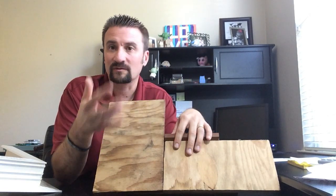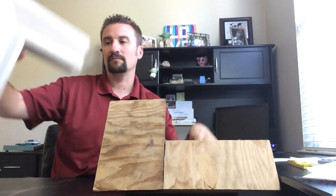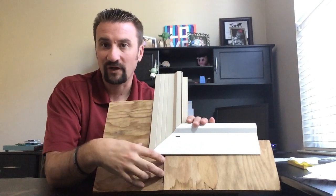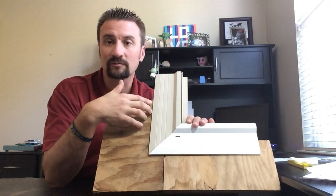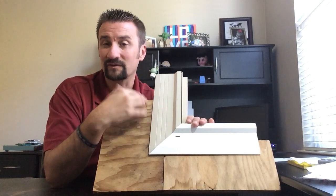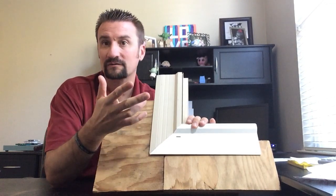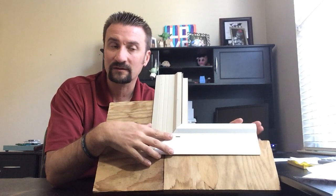So the problem is sometimes people will put a replacement window, which basically means that they're going right over the top of the stucco. If there's any sort of flashing issue on this wall prior to that installation, sometimes it'll even develop a leak, meaning a leak was already there, but it wasn't getting into your house. Now you do this method and you have water in your house. So be careful with doing this method.